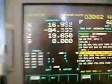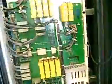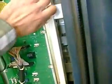This is the second A55 Epsilon, which is basically the same stuff, and doesn't have enough safety. So I pretty much did the same thing, but in this case I also installed a locking mechanism in the door, because there was no locking mechanism. And this is a push button already built in, and I also grabbed signals from the existing IOs on the main PCB. And behind it, there's another PLC that I piggybacked on these machines.